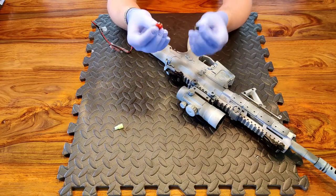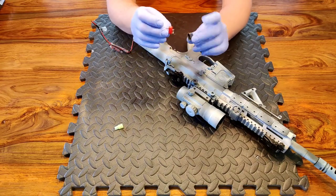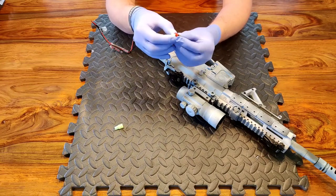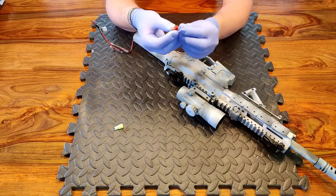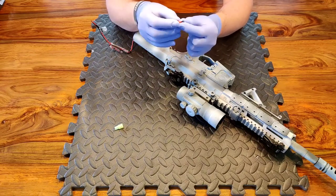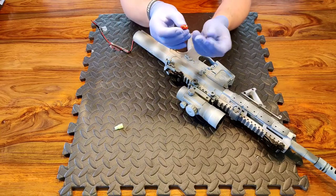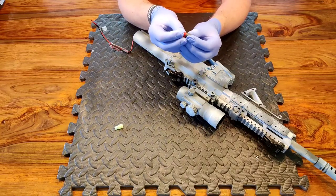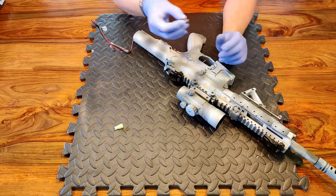Solder one terminal at a time, leaving the other one insulated. That's another reason why we only ever put the female Dean's connector on the battery side and the male Dean's connector on the replica side — with the female connector there's far less risk of shorting out, whereas with the male you've got two exposed electrical terminals. You don't want that on your battery. I like the Amass Dean's connectors — they come with a little cowl to neaten them up when you're finished and they're really good quality. You get about five pairs for about five British pounds. I'll put a link in the description.